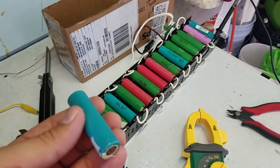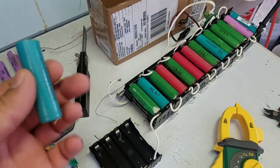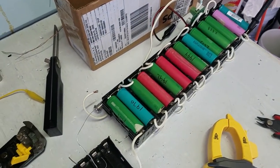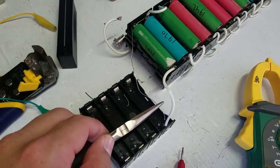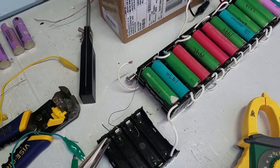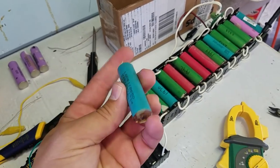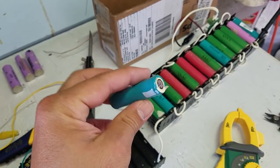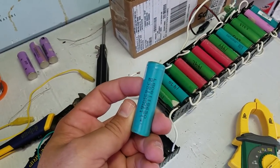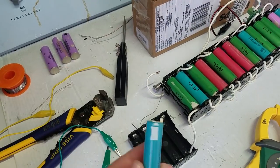I was struggling with the idea of should I just spot weld them or use fuse wire? This little thing right here — just to show that it's actually working, that this is not a gimmick — I'm actually just shorting it out. You see how it became so hot that it actually bent. It is not doing it with this one. So basically it's not dumping all the energy to it — it's just passing energy. The internal resistance inside here is high enough to actually prevent all the energy from rushing in.